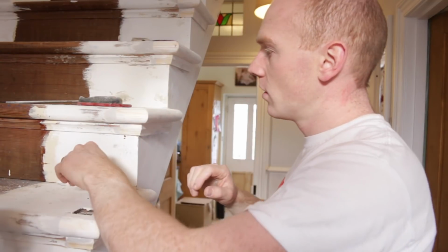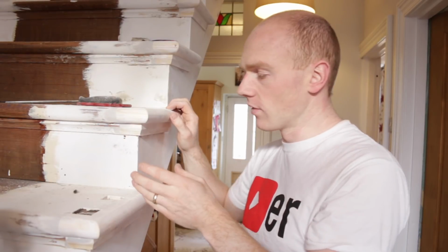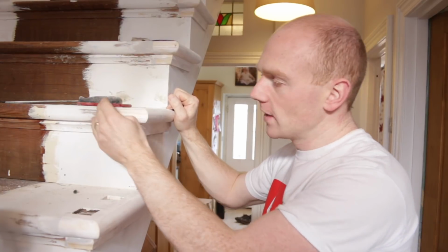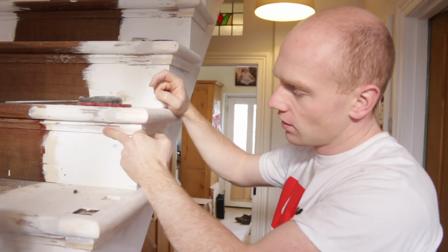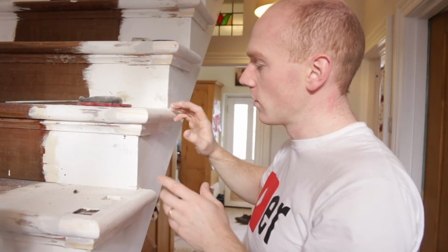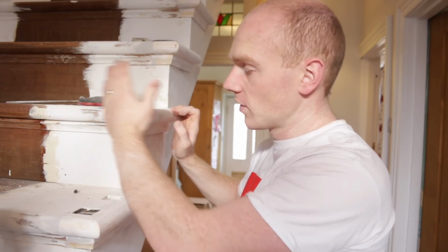And now I've got the tread ends, the kind of nosing on there, like we saw in one of the other videos. There was quite a big step between, and we've got it as close as we could. There was a step between there, there were little bits to finish off, and this curve wasn't quite the same. So it's a bit of a long process, but what I'm trying to do is get it so it's all perfectly smooth, with no transition between the two.